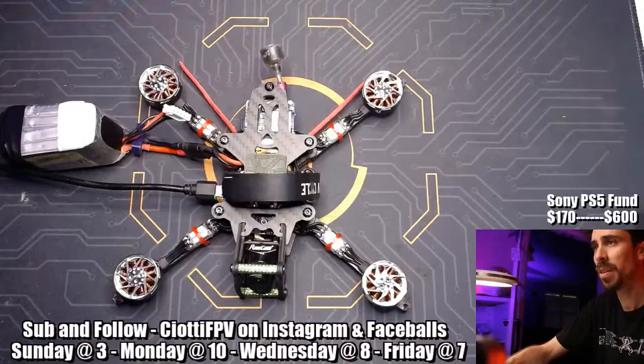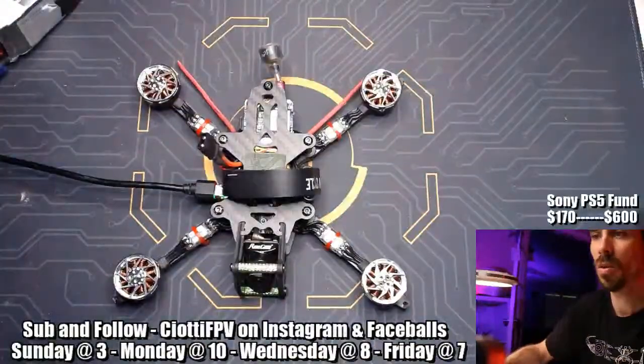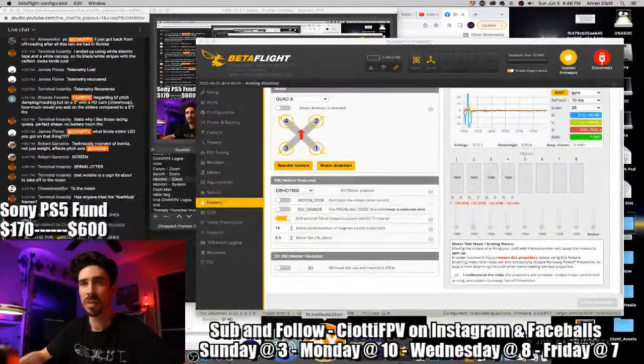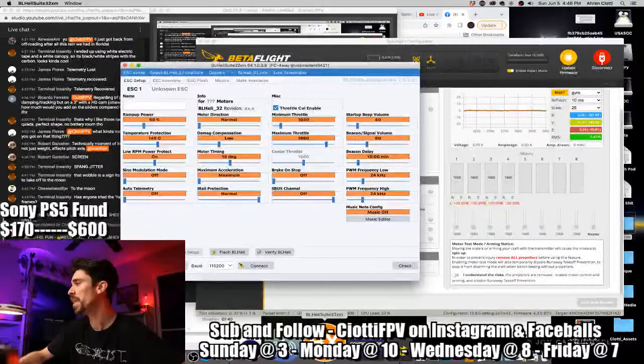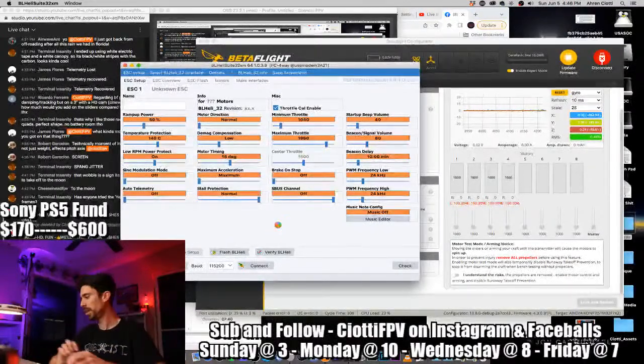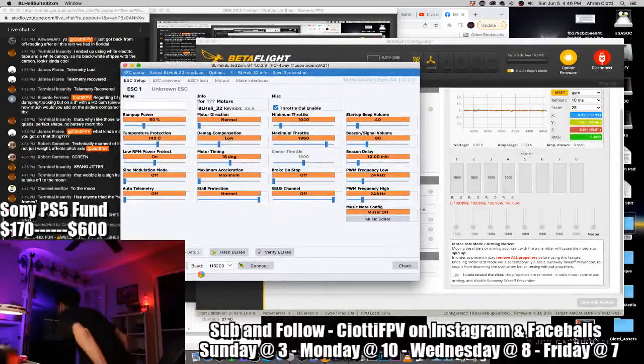Understand the risks. Yeah, I do need to update the ESC. The ESC does not have bidirectional D-shot on it at the moment. So I'm gonna unplug it. I don't think that BL Heli 32 works. ViFly V2, V-I-F-L-Y. They sell them everywhere. Yeah, BL Heli 32 does not work on this computer all of a sudden. It hangs up on this checking remote files thing. Weirdly, it works totally fine on my laptop, which is what I'm grabbing right now.